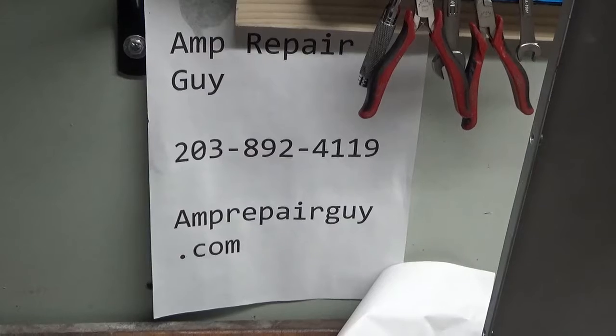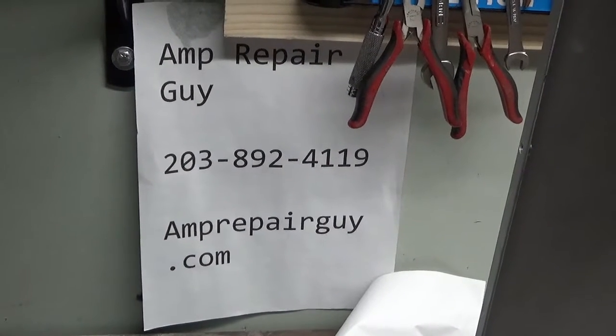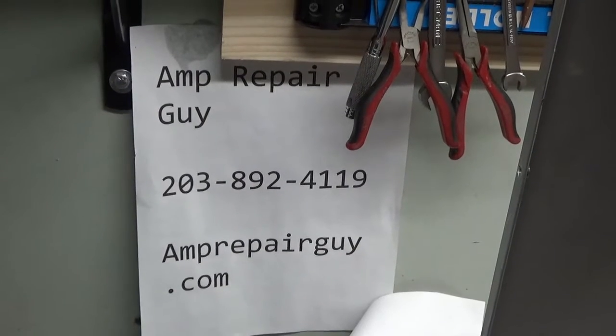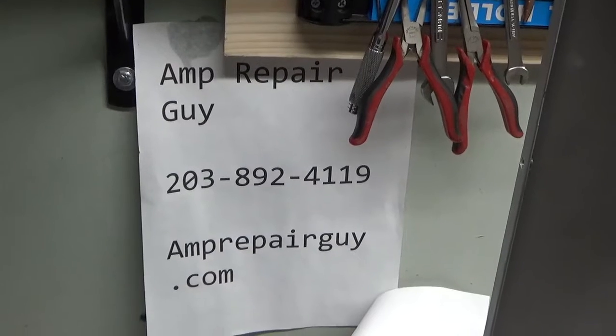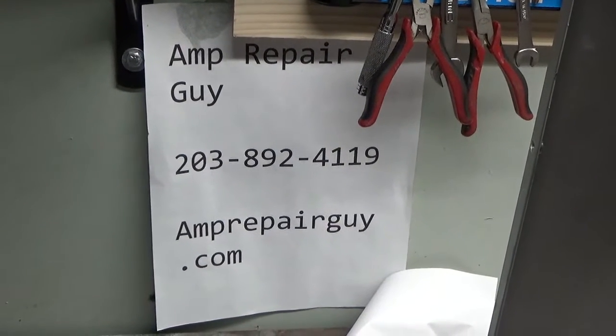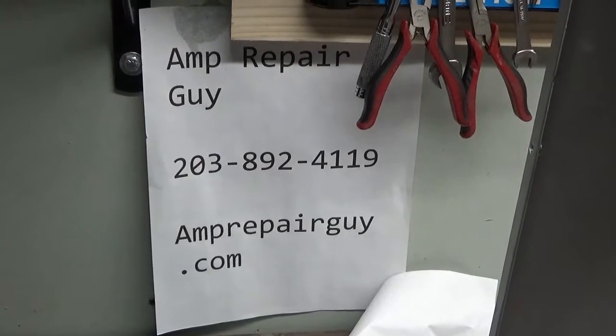The cap I put in — I don't leave it in line all the time. When the amp's keyed, it's taken out of the circuit. It's just in line when it's unkeyed — when the amplifier is connected in line with the jumpers but not actually keyed. So when it's unkeyed, it corrects the feed-through resonance of the air variable.